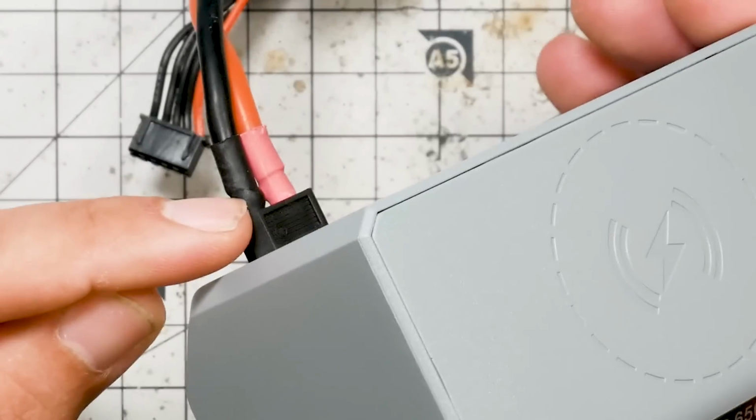If you're powering the charger off of a battery, when you discharge your packs, normally what will happen when you do a discharge cycle is it will just run the voltage through a resistor and turn it into heat. And that's why discharging is so slow, because it just builds up so much heat. The fan runs like crazy, it overheats and damages. And some people say, well, you're wasting all that energy. What an external discharge does is when you plug the charger into a battery, then it discharges your packs by charging up the supply battery.